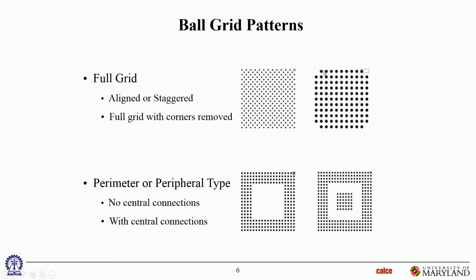So it's really the few joints in the corner that are at risk, because you don't know what the microstructure is for each one of them. So it's a little hard to predict exactly which one. You know it'll be something close to the corner, but exactly which one is sometimes hard to predict. In tin lead solder, it was always the corner one, because there wasn't that much microstructural variability from joint to joint. But that's no longer the case in SAC.